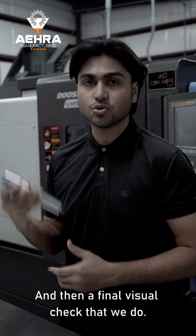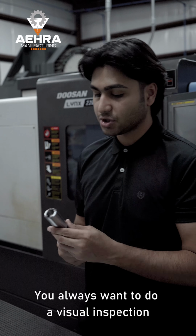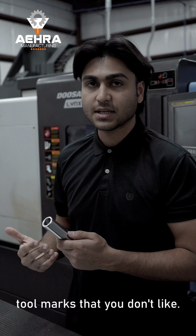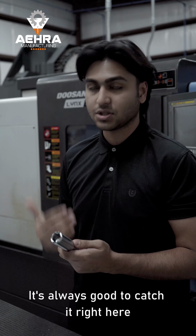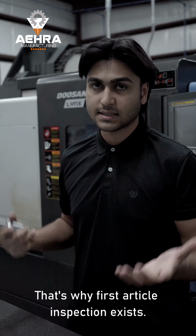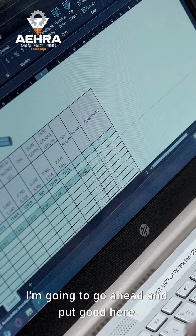And then a final visual check that we do. You always want to do a visual inspection on your part. Look for any gouging, look for any possible tool marks that you don't like. It's always good to catch it right here before you go into full-blown production. That's why first article inspection exists. So everything looks good to me here. I'm going to go ahead and put good here.